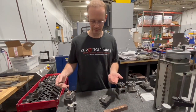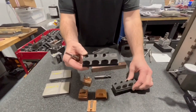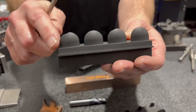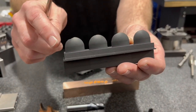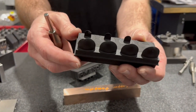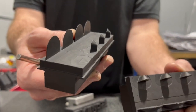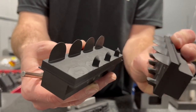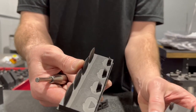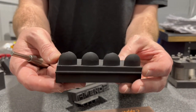Along with chipping or breaking of the electrode, you can see I have a couple of electrodes we've taken off. This whole edge was really almost sharp, and as it got set down and placed, you can see all the chips that happened — even a whole section broke off pretty clean. You can see damage on these graphite electrodes very easily, which means you're making new electrodes when that happens.